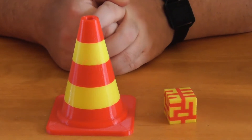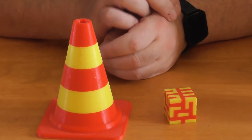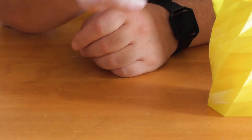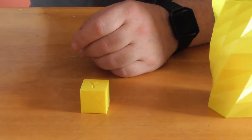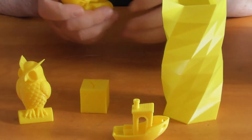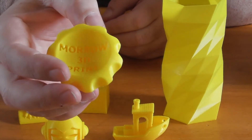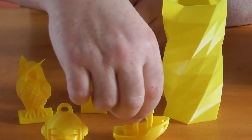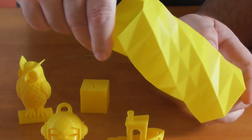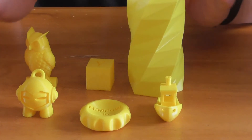As you can see from the dual extrusion print on my QDTek One, it's a high quality finish — a high quality filament. I would highly recommend it. I have also got prints done on my QDTek X1 single extrusion printer. As you can see, excellent finish, high quality, and at the price, value for money too. I would highly recommend this filament to anyone. It's a beautiful finish printed on the X1 at 200 degrees extruder and 60 for the bed.